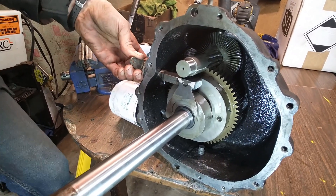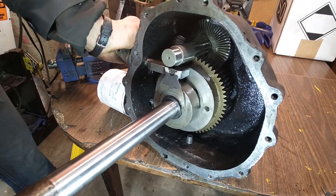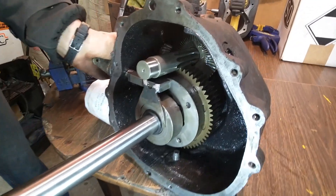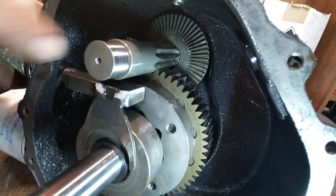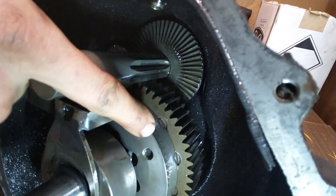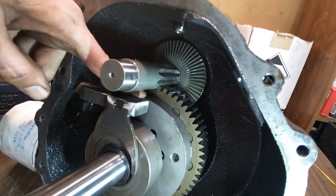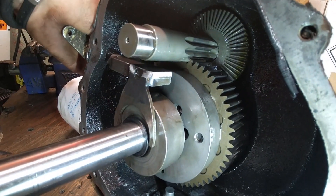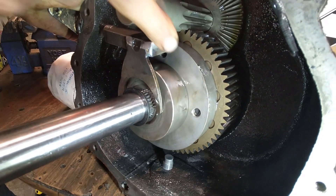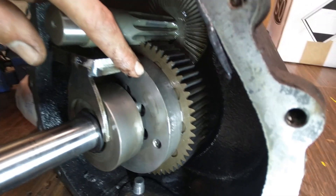You push your foot down and this moves the lever, and you can see the collar moving. When you move the collar, you can see the pins inside here — you have the differential gear, and this is the diff lock hub, and this is the diff lock collar. This collar floats independently right now; that pin is not connected, so the two axle shafts are connected only through the differential. When you push the lever down, this hub will fall, completely closing up against this face, and fall into one of the slots in this hub.